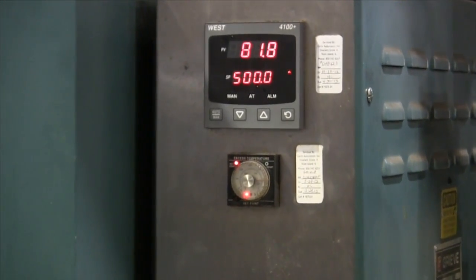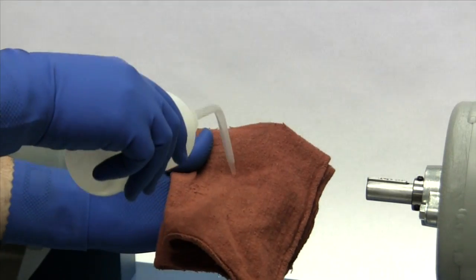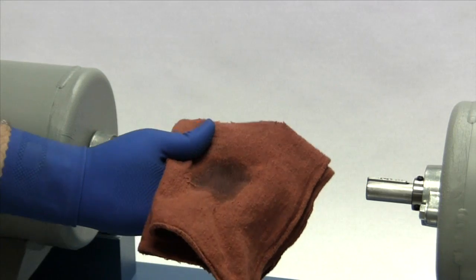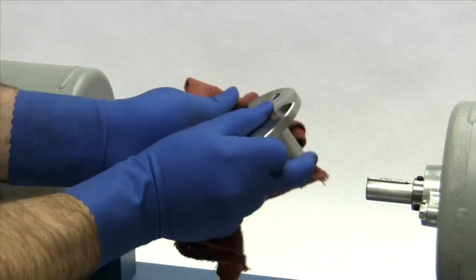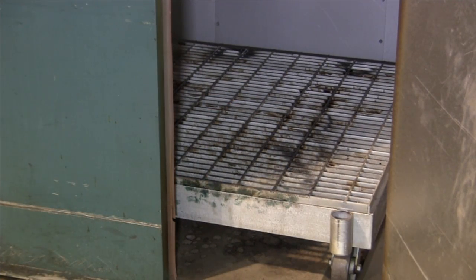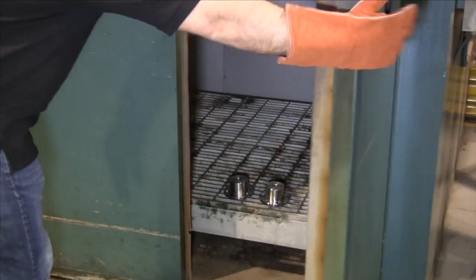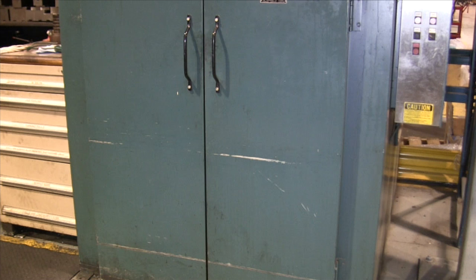While we wait for the oven to preheat or come up to temperature, we can use our cloth and cleaning solvent to clean the surface of the hubs and remove any protective coatings used to protect the coupling during shipping. When the oven has reached the desired temperature, we will place the hubs on a rack, raised off the bottom of the oven to ensure more uniform heating of the hubs. We will need to allow enough time to ensure that the hubs are thoroughly heated to the desired temperature. The required time will be dependent on the type of oven and the size of hubs being heated.